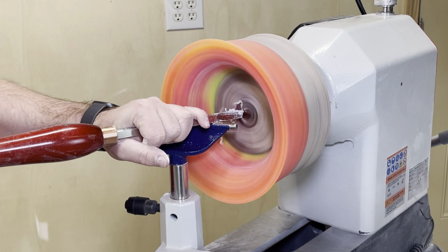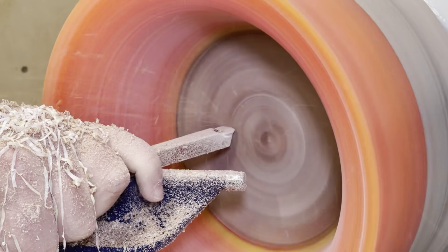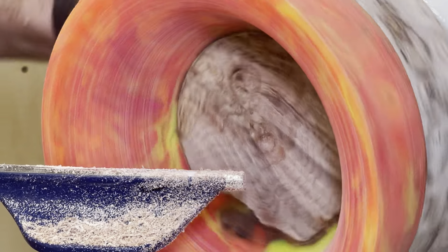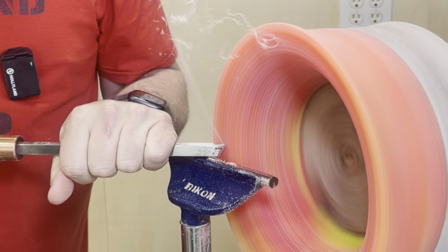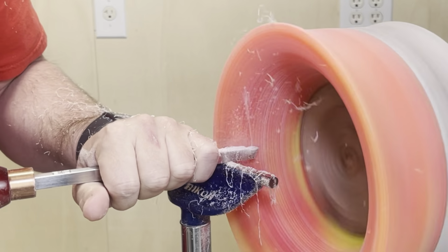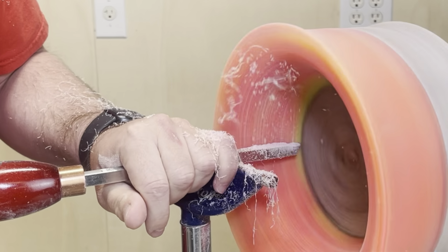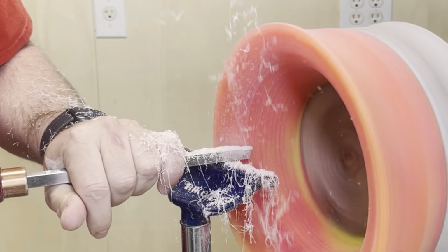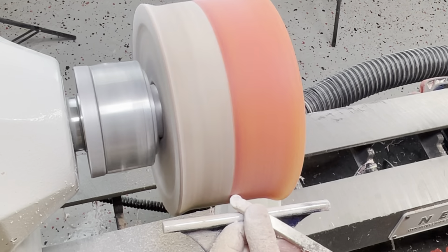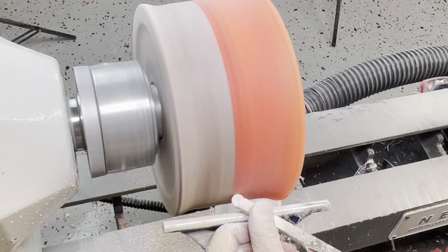It is so cool. And now we're just going to get the bottom of this thing smoothed out, and then kind of just go over it the last couple times to make sure that we've got all the big ruts out of it. I'm just using a regular finisher to do this process, but if you have a pro size finisher, it works so much better because the circle is so much bigger. So all of the ruts you put in there with the number one hollower, you can take out with the bigger circle, and then it helps you out with sanding quite a bit.